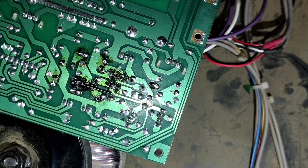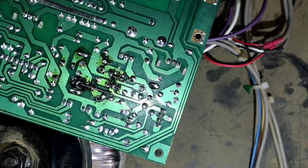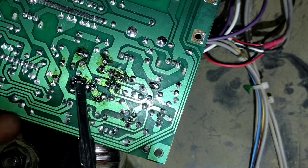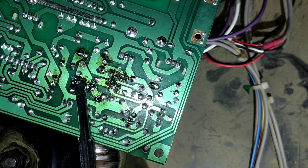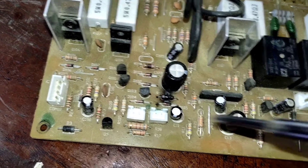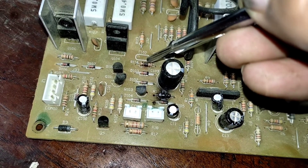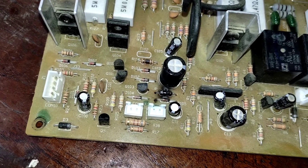I've just figured out how the two resistors burned up — it's not actually a voltage problem. Look at that — this needle or foreign object has somehow found its way underneath the board. You can even see black residues which are a byproduct of fire. So this foreign object was shorting out components and creating extra problems. Those are the two burned resistors, right there. I'll desolder them and find replacements.